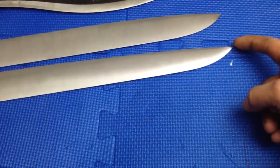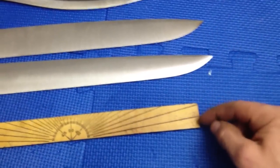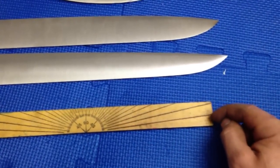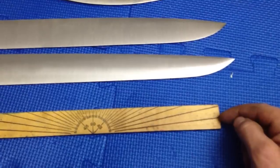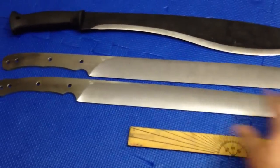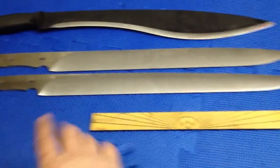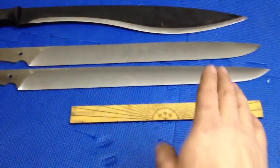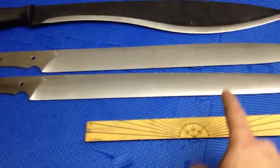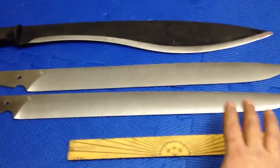And what it let me do — because I moved that point downwards — imagine the stack, and on this one the tip was up here, and I only had this little bit to drop. So I moved the tip to actually the lower half of the stack. I have a little smaller belly, but I have more curve to the blade — that curve from the handle to the blade, that angle ratio. And also dropped off a little more weight up front, so even though it has more blade, it's still less blade-heavy, it has less weight up front.